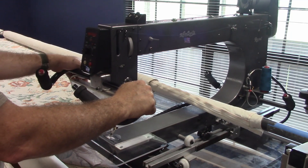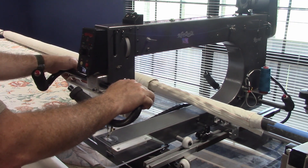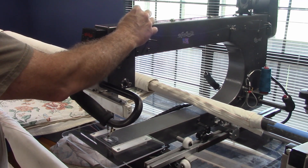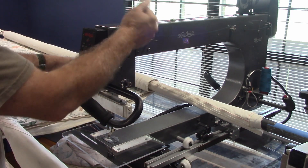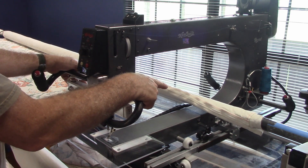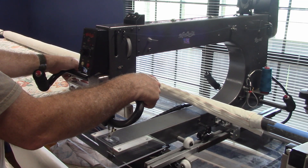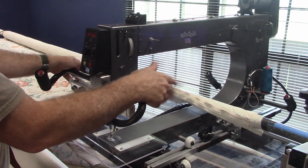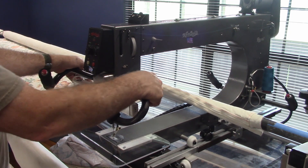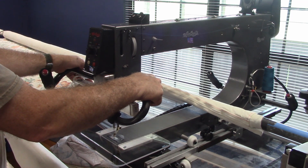That's all I've got on this project. I was really pleased with the way it came out — it works really well. It's very simple: just 12 volts with a switch that goes to the magnets, a little flashing LED to help you remember it's on, a small transformer, and some magnets. It cost me less than $50 and saved me $800 to $1,000. Everything for these quilting systems is amazingly expensive. Anyway, I hope this was interesting to you — thank you for watching.